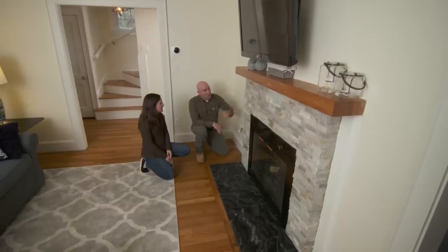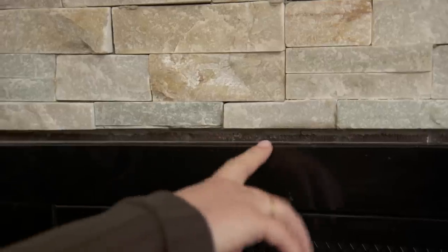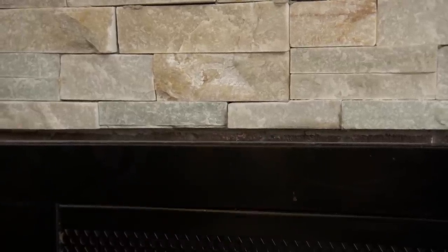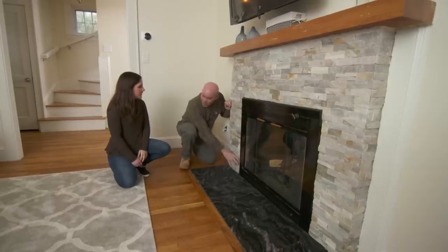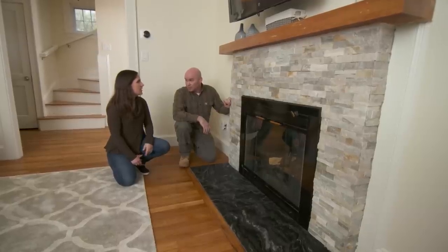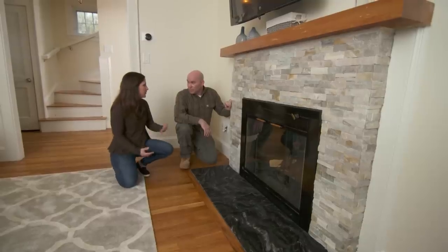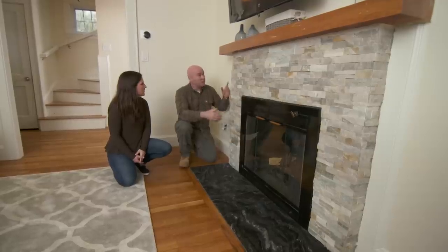Now that we're down low, Laura, look at this. See how they tried to mate the stone to the mantle? Yeah, it just looks so messy — very sloppy job. If you look here, you can actually see the red brick underneath. I was wondering if it was possible to clean that up and just get it back to the original. Unfortunately, no. Once they applied this stone with that thin set mortar, it takes a grab and leaves a lot of residue on it. So we'll take a lot of it down, but we're not going to be able to clean that brick. But we do have what they call a thin brick veneer, and that will give you the appearance of a brick. We're going to bring it up eight inches on each side, and that will mimic exactly what you had back here in 1929. After that, we can add the wood mantle for the more traditional look. I'm not a carpenter, but I'm going to leave the brick in such a manner that they'll be able to bring the mantle in and tack it to the wall and be done.